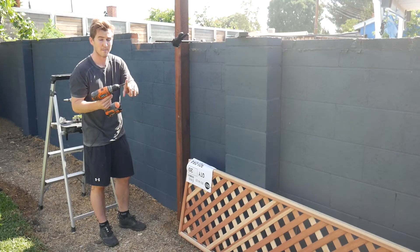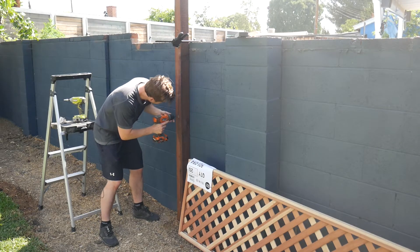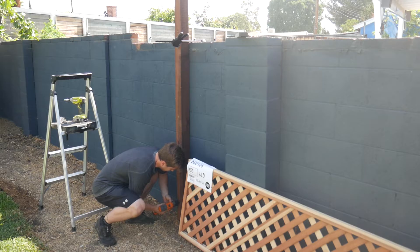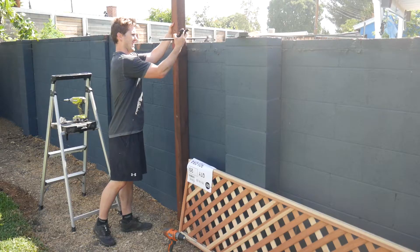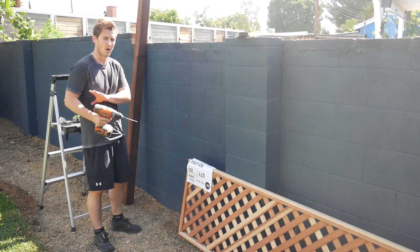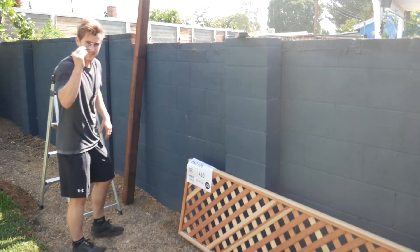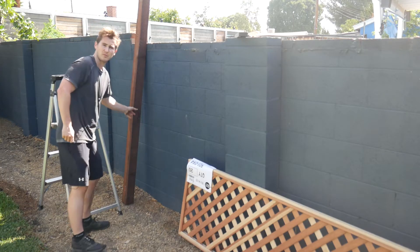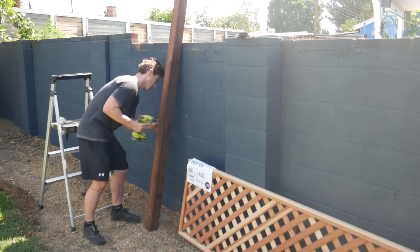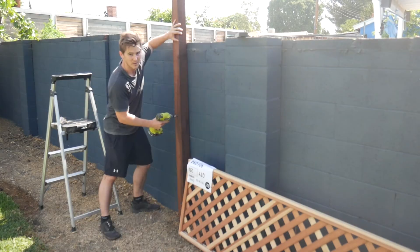Once I know the post is in place, I take the drill with the masonry bit that was provided, feed it through the hole, and mark exactly where the screws are going to go — for the top hole and for the bottom one. Once those are marked I temporarily remove the post and finish drilling out the pilot holes in the wall. Then I take two screws, pre-drill them into the holes I just created just deep enough so the other side is poking out, which allows me to line up the post and permanently fasten it.